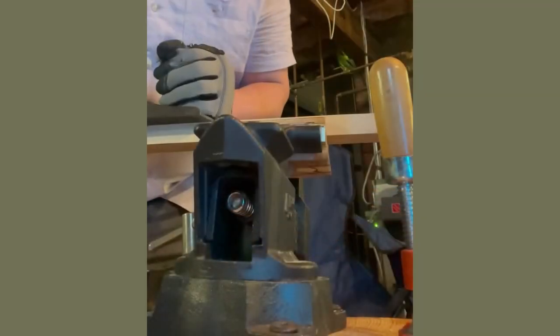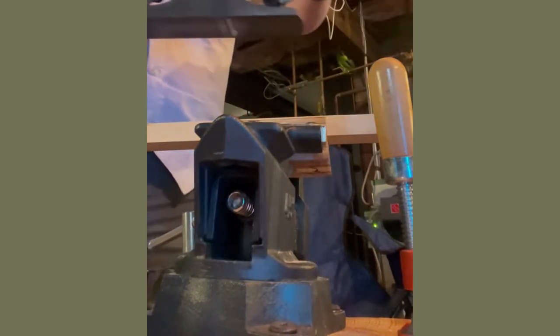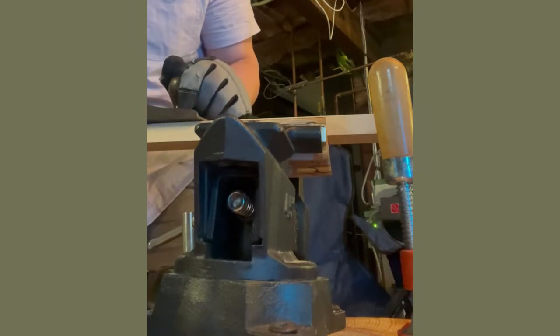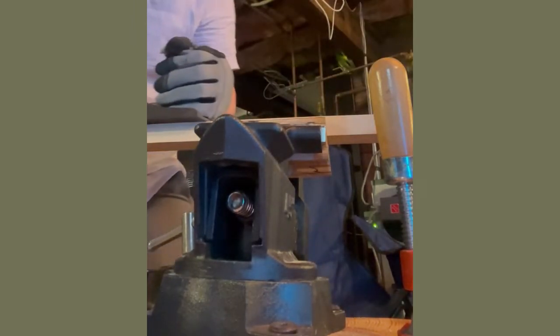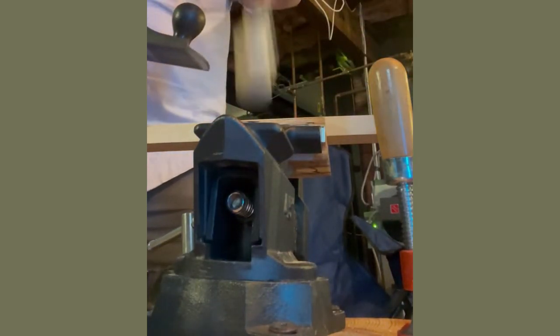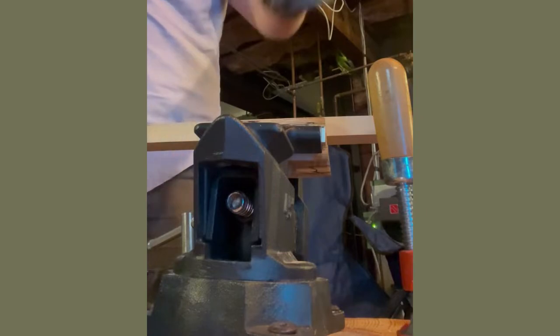I cut the length and width for the handle of my mallet. I finally was able to use both hands on my bench plane because I wasn't worried about the wood slipping out of place, which meant I could get thin, beautiful ribbons. I planed down to get flat sides that are relatively square. I was still in the process of making winding sticks and hadn't fully learned how to get proper square sides, so this was not a perfect process, but I got very close.